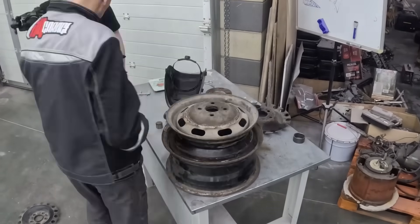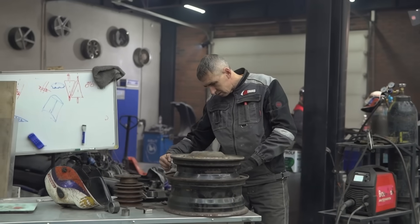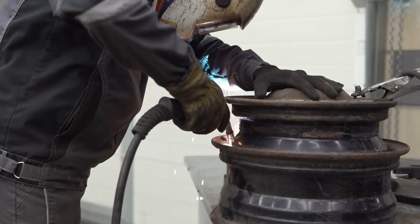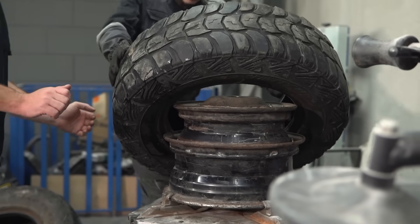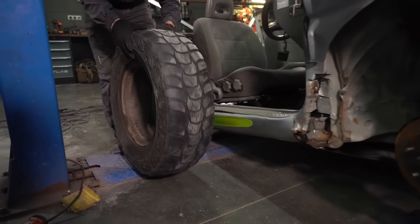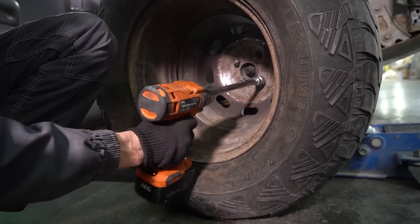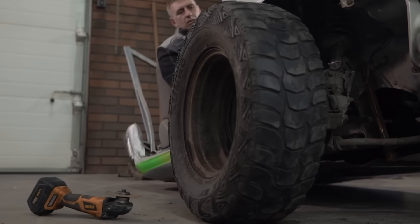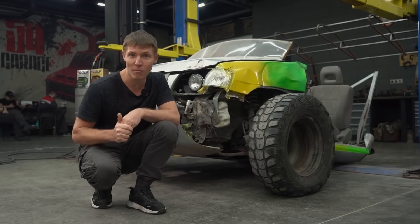It is currently winter, and that means that we're going to be accelerating over the snow. Even packed snow tends to be pretty soft, and there's a deep layer of it. As such, we need as much contact patch as we can get. We're going with 15-inch wheels and a 235-section tire, one that'll work at extremely low pressure. We did have to modify the wheels to get this to work — we took the stock Mazda rims and welded on pieces of 15s of the required size.